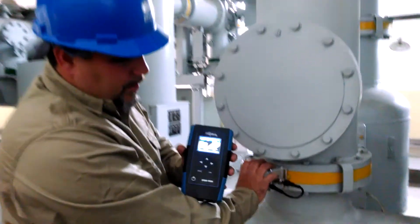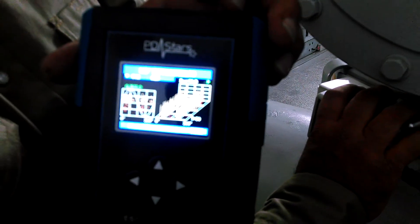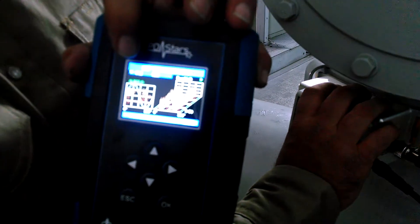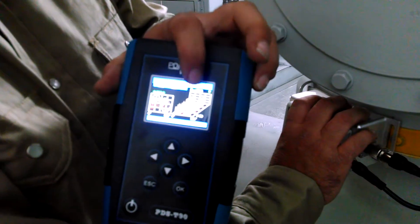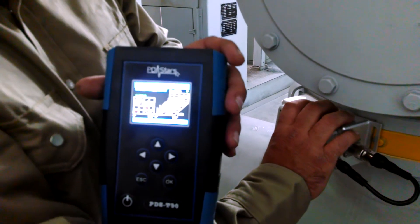As you can see, we're picking up bipolar RF signals. This is indicative of partial discharge activity. PD happens synchronous to the AC sine wave. We're referencing the AC sine wave from a simple 110 outlet so that we can determine if the signals we're picking up are indeed indicative of a partial discharge or whether it's noise.